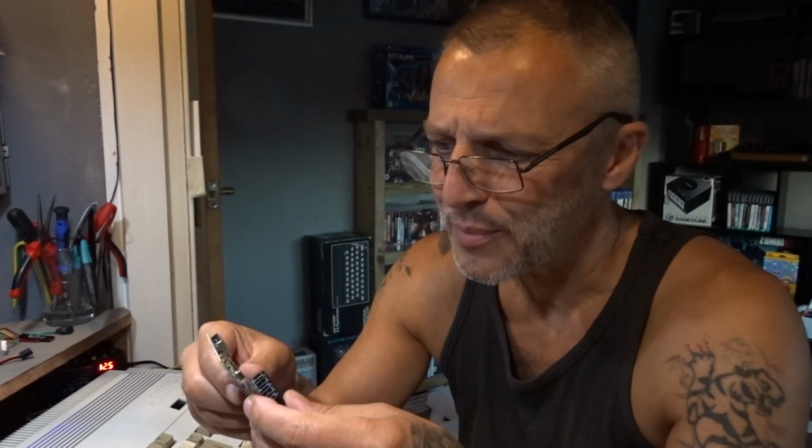but that model, that board, the long board, you can't have the RF box off. It needs the RF box on the board because there's an amplifier in there, which makes the board work. So that wouldn't work with this. So I might use this for this. This is an upscaler, HDMI. It does 720 or 1080p with a little toggle switch here. Probably just broke that.